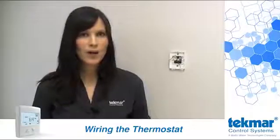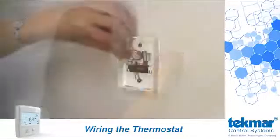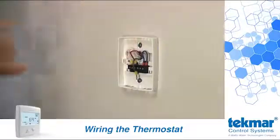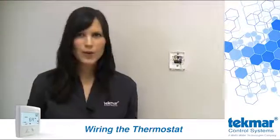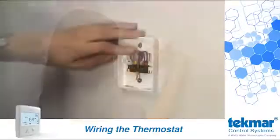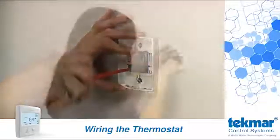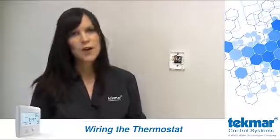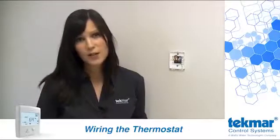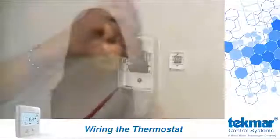I'm going to demonstrate wiring the thermostat to its own valve with power from a 24 volt transformer. We'll connect the R from the transformer to the R on the thermostat, and likewise the C from the transformer to the C on the thermostat. We'll add power to the heat relay by installing a jumper between R and RH. Lastly, we're going to bring the wire in from the zone valve. The other wire at the zone valve will go directly to the C on the transformer, and the wire from the zone valve will go to the W1 terminal on this thermostat.